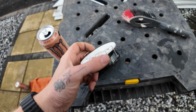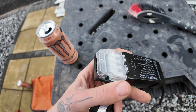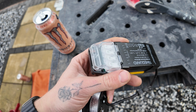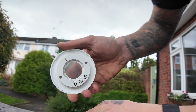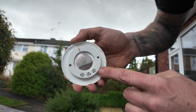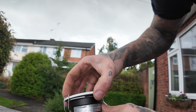So this is time guard. You can put this first one on the circuit and then do a switch out. So the switch out will actually, to my knowledge, switch all the other ones on a sensor. Pull that out, the connections and the settings for the sensor range, lux and time are in the lid compared to in that. Oh, that's pretty nifty.